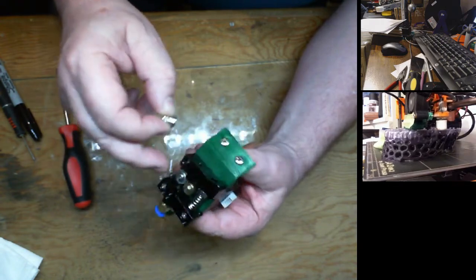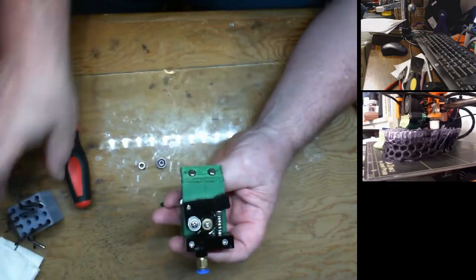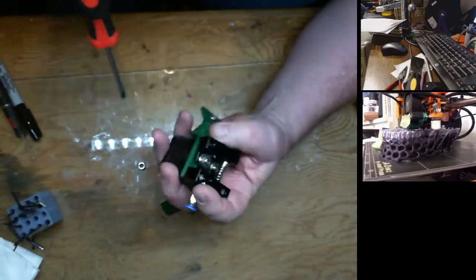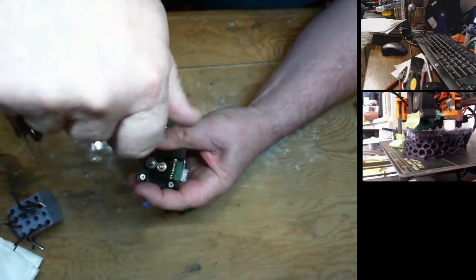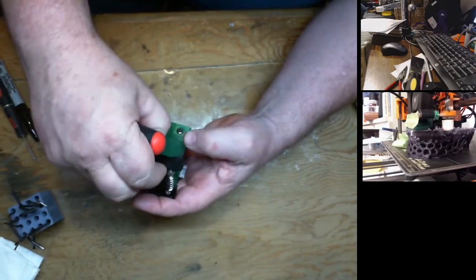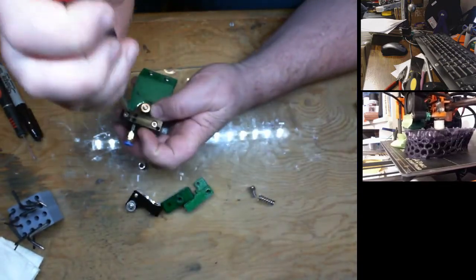And that should give us more torque, because what I was running into was that this extruder gear setup was slipping. And I thought that, not slipping, skipping. I thought that was what my problem was. Yeah, I don't need that one. With the under extrusion, so I put a new gear on extruder 0 and left this one stock and adjusted, and that's when I discovered my problem with the fact that the front panel couldn't control extruder 1.